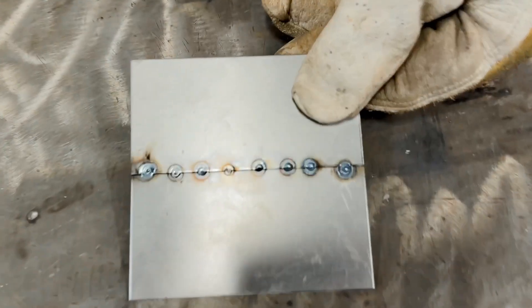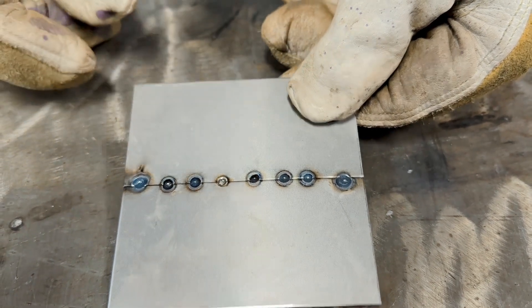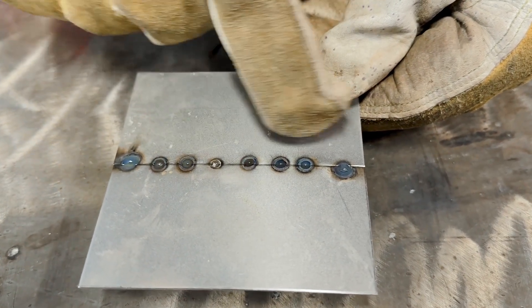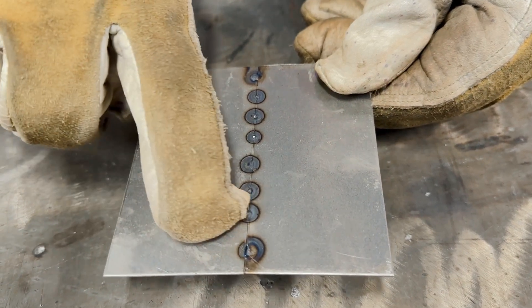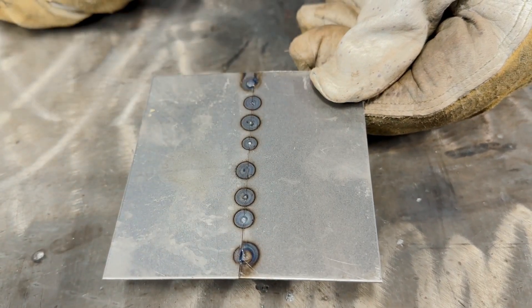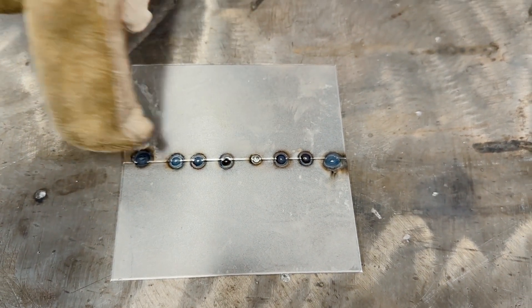The third one had a little bit short tungsten-to-material distance — that's how the sound was a little different. The other ones the distance was good. You can see the tack is much more focused — about 60% of the size of the other tacks. On the back side you see it coming through all the way, full fusion, and better penetration. The heat-affected zone is much smaller, much more focused. When you weld over these with filler rod, you're likely to consume the entire tack rather than just weld over part of it.